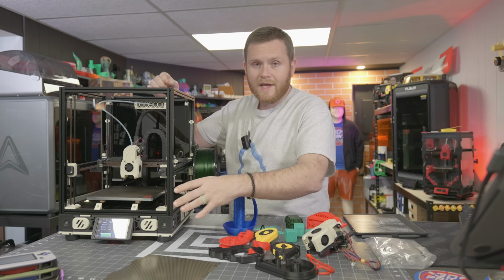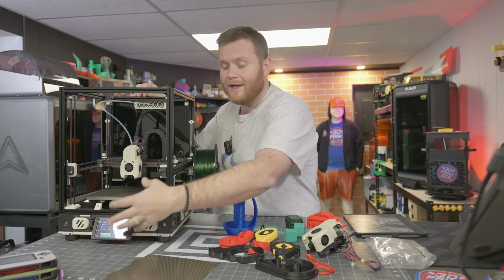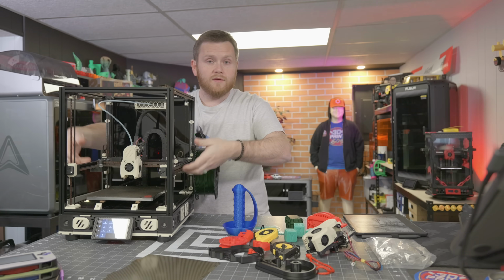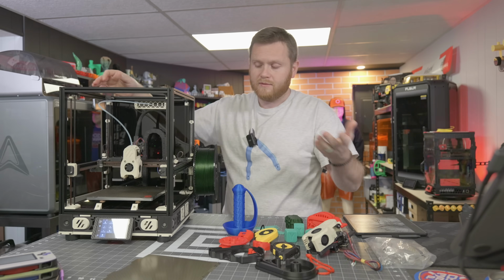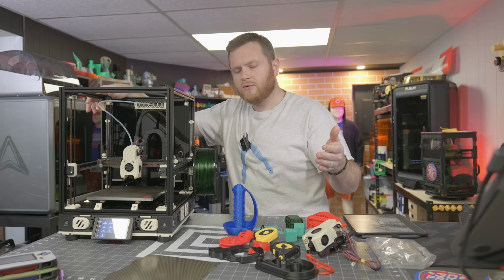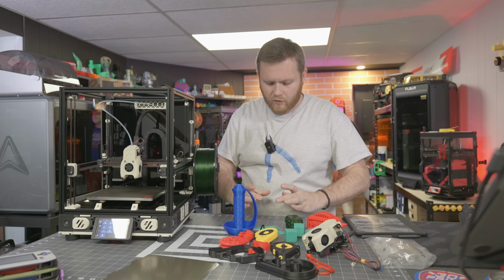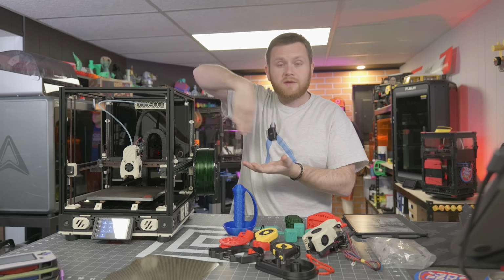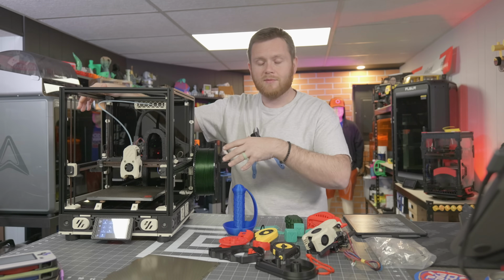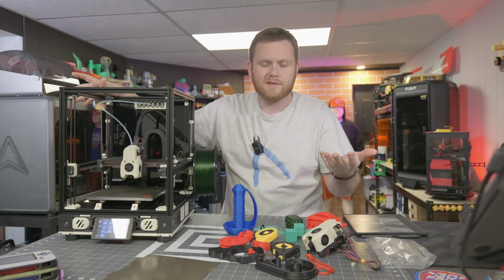So all of the weight of the machine, all the mass, the electronics, everything that's heavy is down below and stationary. It does not move, whereas the light tool head and the whole gantry system flies around. And that's what makes the 2.4 really special. It's actually somewhat similar to how Delta machines are, where the Delta platform is also on the very bottom, and then the Delta tool head moves around both up and down, left and right, forward and backward. It's a similar idea, except this uses the Core XY kinematics, whereas Delta uses Delta.